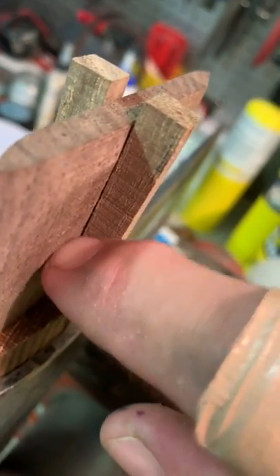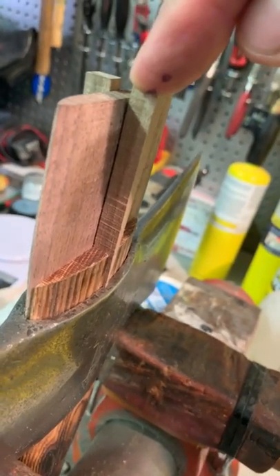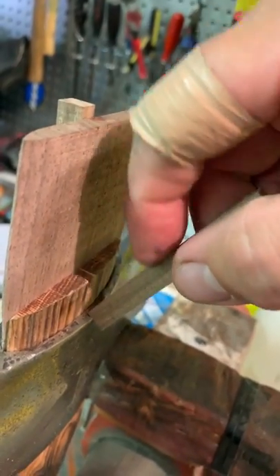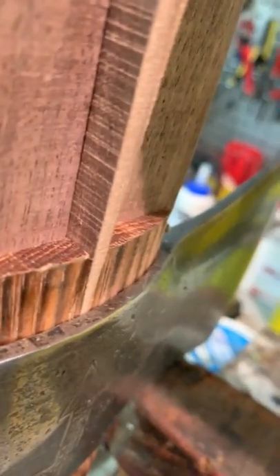It's really important that the edge of this cross wedge be completely flat so it lays tight against the center wedge. If it's not flat it's going to flare out and break off. You'll also notice one isn't going in all the way — I think I reversed them — so there we go, that one goes there and this one goes on the other side.